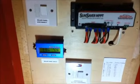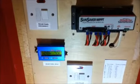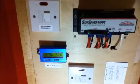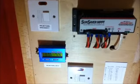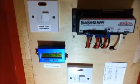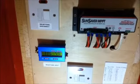So we obviously have the peak wattage, that's the highest value generated. Then we have the peak current. Obviously if this value reads 0, that means there is a break in the connection between the solar panels and the meter. It would also show 0 current, 0 watts, and you would have 0 volts coming in. So this gauge would alert you to that if there was anything wrong.